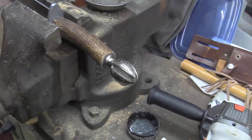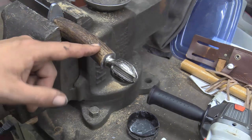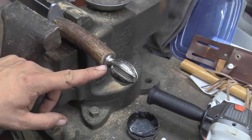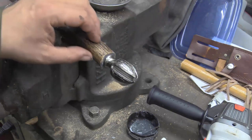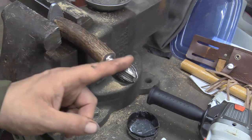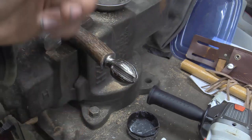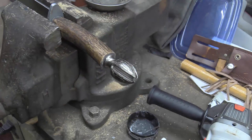The fancy handle has arrived. I drilled it out, packed it with JB Weld — actually what I used instead of epoxy — and bent my all-thread tang so it would line up just how I want it. I filled the handle and guard with epoxy and it's been setting for a few hours. I should let it set till tomorrow, but I don't really care for the fancier pommel so I'm going to take the cutoff wheel, whack that, then turn it down and polish everything up — provided this doesn't turn into a catastrophe where I ruin all my hard work.